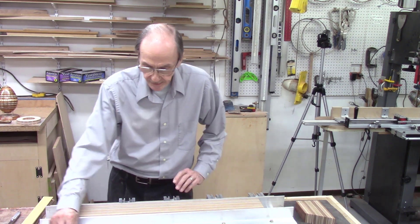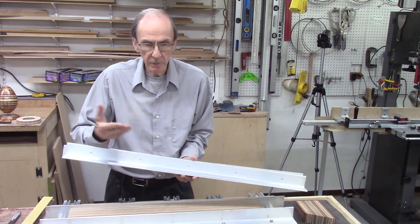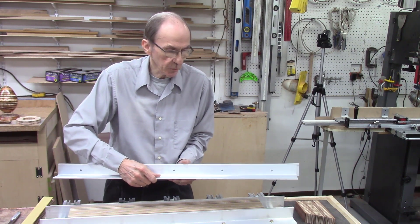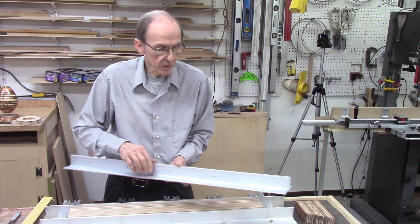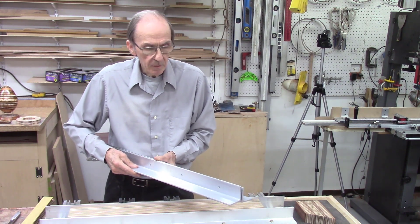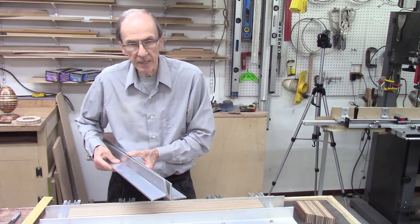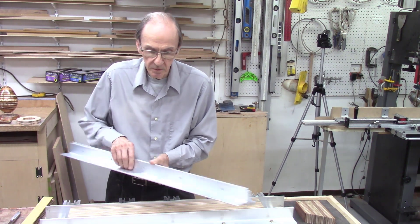The system began initially with just two angle irons — I put a bunch of laminate boards together, glued them, and clamped them between the two angle irons. The system worked pretty well, but the problem was that eventually the angles began to slip and slide, ending up with a slight angle, which meant I didn't have parallel sides and edges on my laminate boards.